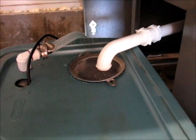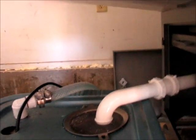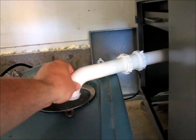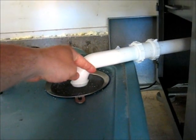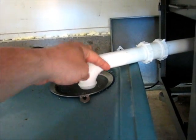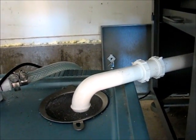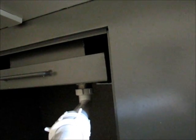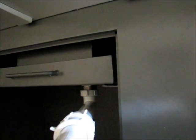I'm using a Sterilite 73-quart tub for the reservoir. The height of it relative to the chip tray is such that I have just enough room to get the downspout from the tray over the side — in fact, in some ways it's sort of sitting on it. That limited clearance is one of the reasons I went with a smaller strainer in the first place. It would be nice to modify that drain in the tray to have more room, but it fits, so no problem.